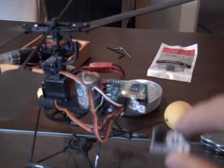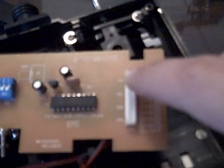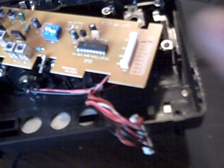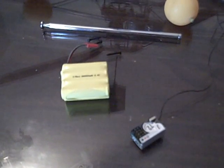Look at this little receiver right here. I bought this several years ago and it's the exact same receiver that comes on the helicopter. It even lays out channel one, two, three, four with a nice little plug I can just tap into. Using this board hooked up to the Arduino, I can simulate my thumbs moving the joysticks by the voltages I output here. All I have to do is test the system, hook it up to an alternate source, disconnect all these wires, connect them to the Arduino, and see what I get — that's the plan.